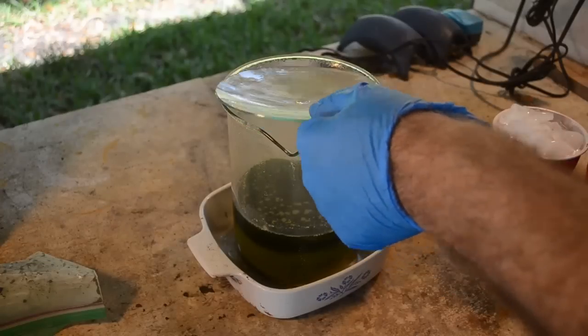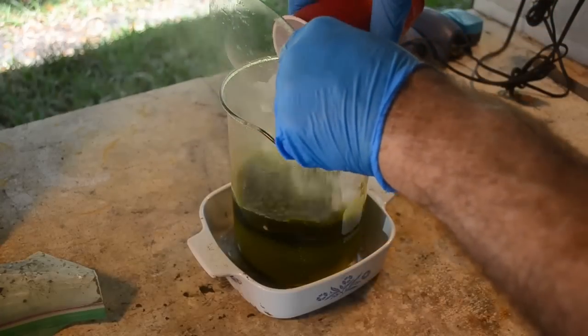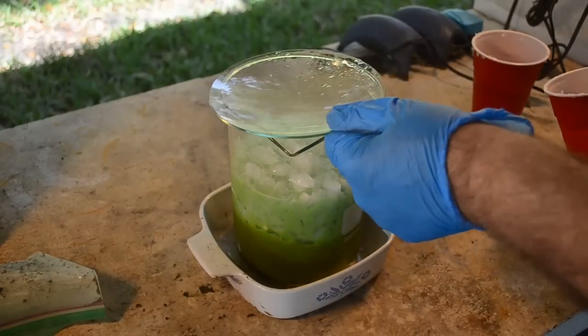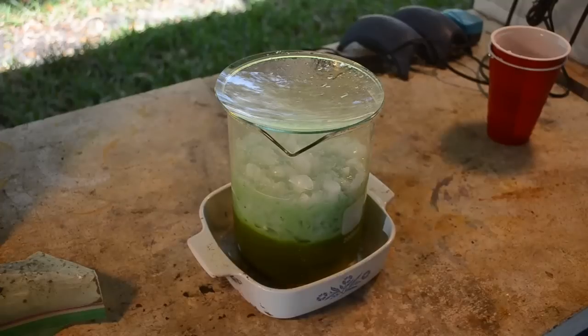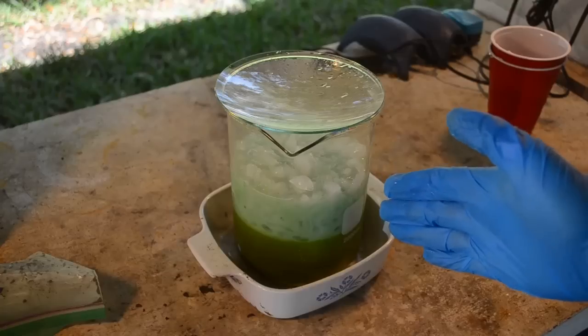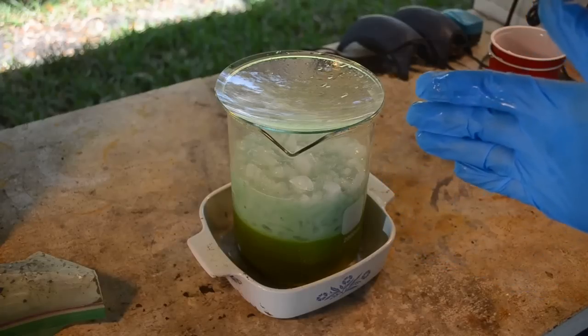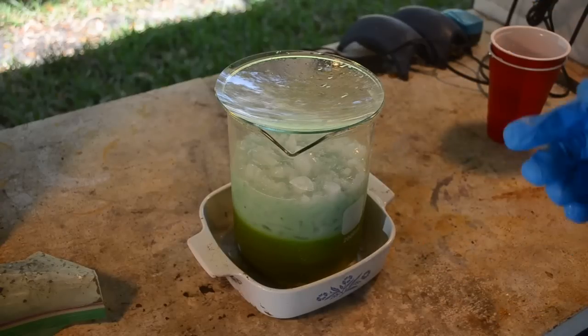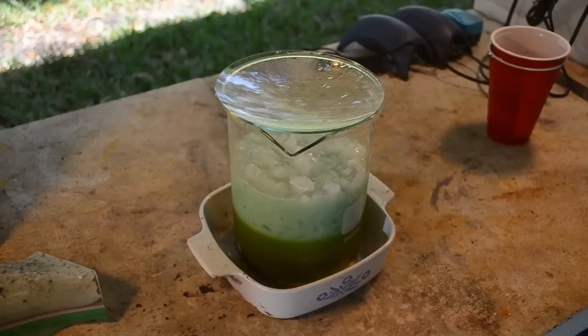Got this off the hot plate so it can start cooling down. Put the ice in it — it's turned into lime green Kool-Aid. Yeah, this is going to be an ugly gold drop. We'll let the ice melt to cool and dilute this stuff. Things like lead sulfate and silver chloride will drop out of solution. We can filter this and hopefully get a reasonably clean filtrate, although I'm not going to get my hopes up — it's probably going to be nasty green and opaque.